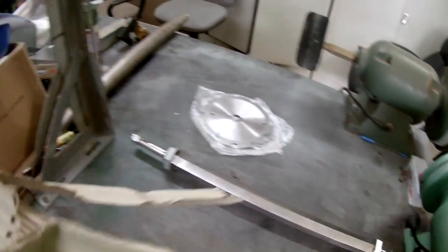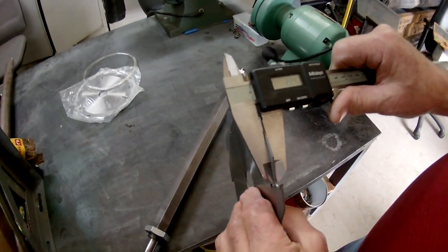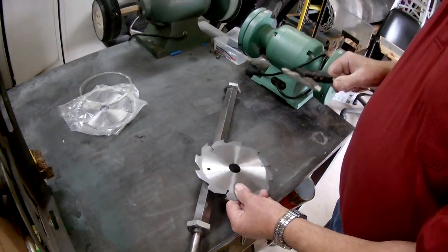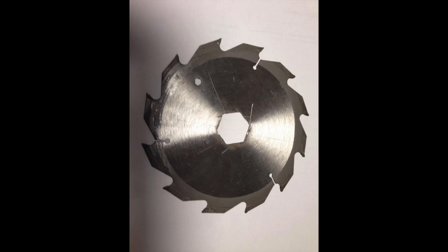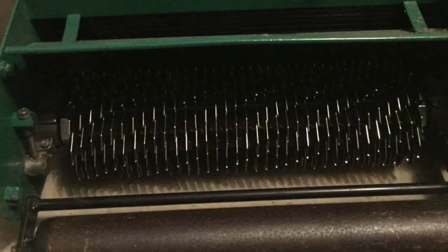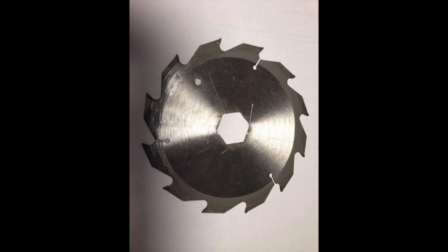I've got some blades which I found on eBay and a shaft that I got from Golf and Bowling in Victoria. Now the blades have to be thin — a couple of mil is ideal. I found these blades on eBay but I haven't been able to find them since. The problem is that these have to be modified to fit the hex of the shaft. We've put the hole on the first one to fit the shaft, but the big problem is I've got 12 teeth and a six-sided hex shaft. So to get that spiral effect like other groomers, I'm going to have to move the hex cutout by about five degrees for each blade, which is an absolute pain.